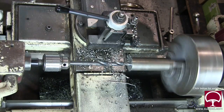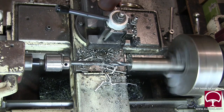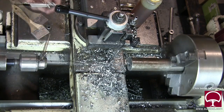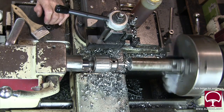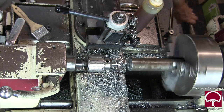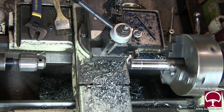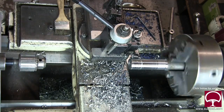Now we're over to the lathe and we're going to drill a through hole. That shaft is about 14 inches long, so we can only go through halfway on one side, then turn around and go through from the other side. But first we want to make sure we have a center in there for our grinding purposes, then start turning the OD down. I measure that because that's where we're going to put our thread — and that's the undercut on the back side for the thread clearance.